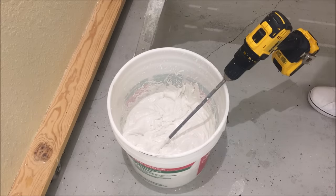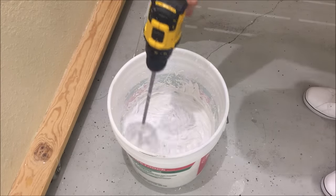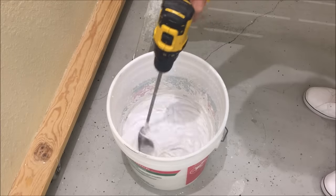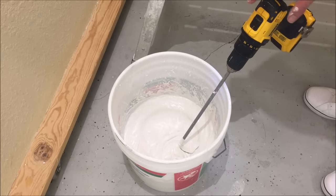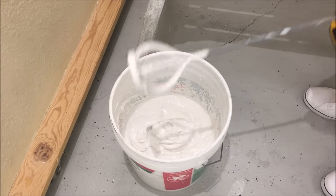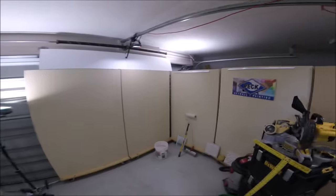It's been 10 minutes. I'm going to go ahead and add a little more water — I've probably put in six to eight ounces total. Pretty much go by feel and how it looks. The paint mixer I'm using is attached to a cordless drill and you can get it at any big box store like Lowe's or Home Depot in the paint section. If you did mix it too thin, you can add a little more joint compound and start the process over. Even if you start rolling the mud on and it's too thick or too thin, you can make an adjustment as needed.